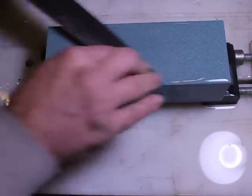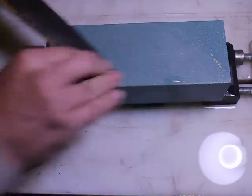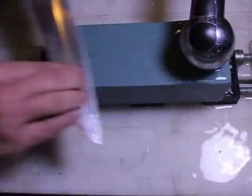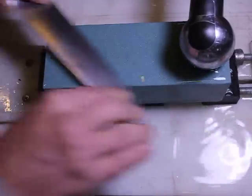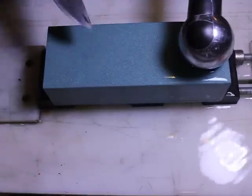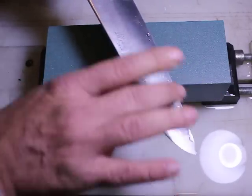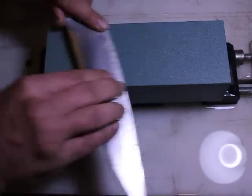It's a good bit smoother than the 60 grit stone. What I'm intending to do is get a basic edge — not anything spectacular, just establishing a basic edge that will have some level of cutting performance. Right now I'm doing it all on one side. I'm not noticing hardly any grit building up, so it's not going to be a fast dishing stone. I'm going to let it run a little drier to see if we get any mud buildup, and just feeling it, I have a very well established burr already up to about right here.